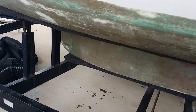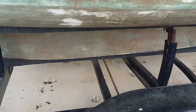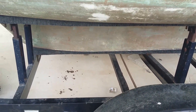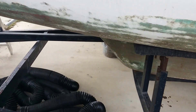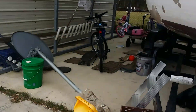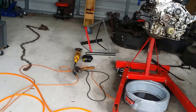We're trying to get it off the trailer. I saw a video where people are using boat stands to get their boat off the trailer. It's a long process because you have to get it around all these supports — you need like six of them, minimum four just to lift it, and then two more to replace the ones that have to be moved through all the frame supports. So yeah, three feet — that's fantastic. I tried it out and it does fit behind the wheel wells under there at the lowest point, with more than enough clearance to put a two-by-four thick piece of wood in there.